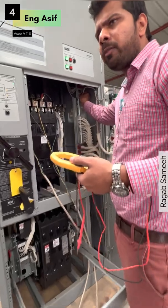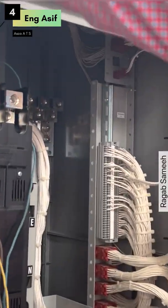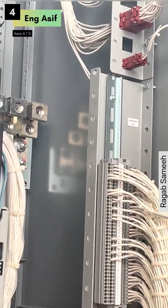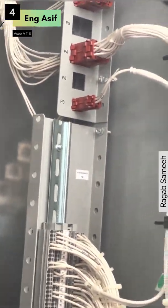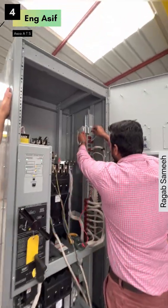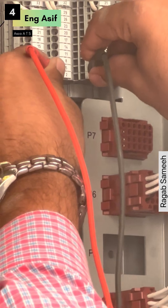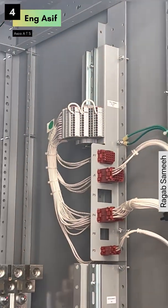You can remove this wire for safety — P3. Remove it and then you can do the maintenance. The generator just started. I will show you. P3. Now it is on the test. Wait — number one, this will start? Yes, one and two. So now it is open, which means it will not start the generator.